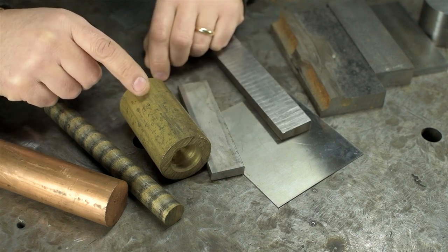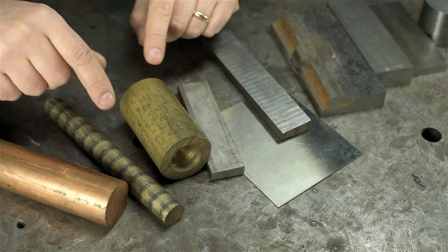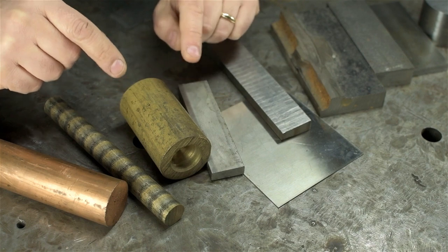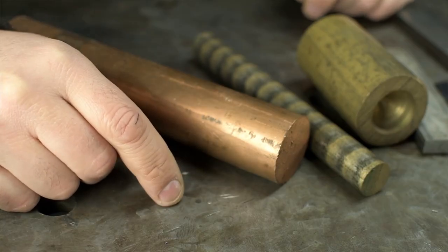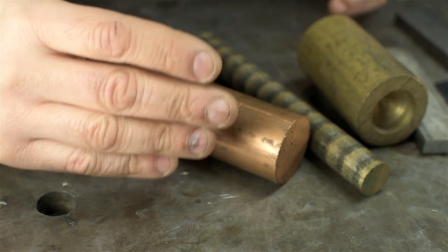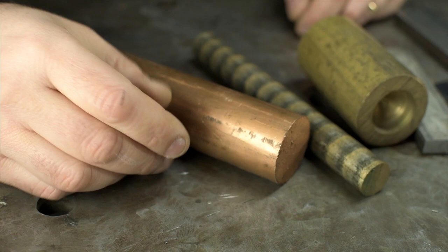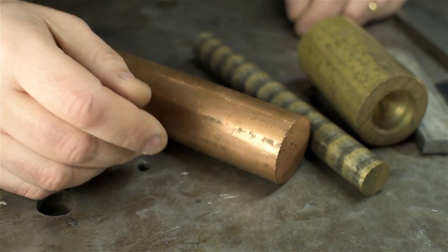Brass is tricky, also has a lot of zinc in it, I think, maybe lead. In fact, there are different flavors of these copper-based alloys, some that weld better than others. Bottom line, there's more in welding than just the right welder. But the right welder, of course, goes a long way. The point of this is to show you what you can do with just DC TIG. I'm sure there's metals that I've completely left out. You can, I think, TIG weld gold and silver, but unfortunately I don't have any of that bar stock on hand.